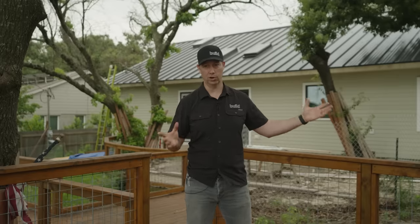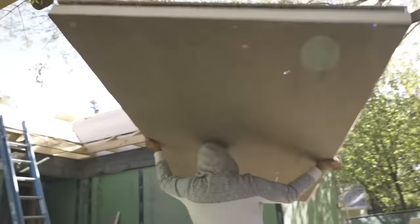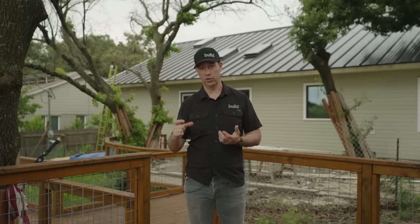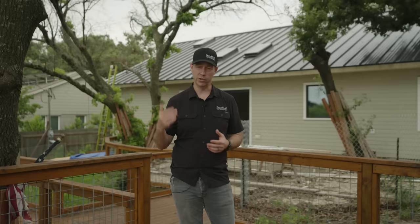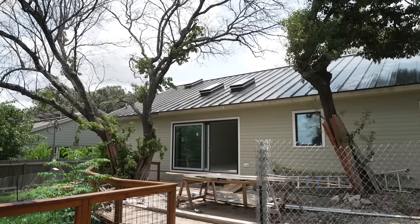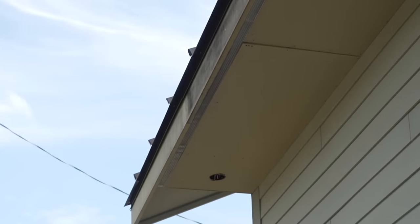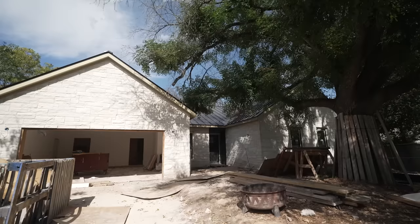Both houses started the same way with a two-inch layer, but here's where they differ. On this house, I used the Hunter panel for the second layer. Looking at the cross-section, the Hunter panel is a two-inch insulation bonded to a one-inch wood spacer bonded to a 5/8 CDX roof deck. This configuration lets me vent my metal roof from the underside — I've got a vented eave on all four sides of the house, allowing air to come in underneath the roof deck so I could install my metal roof conventionally.